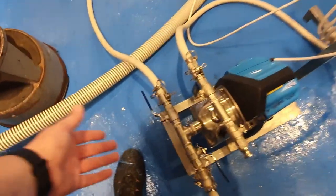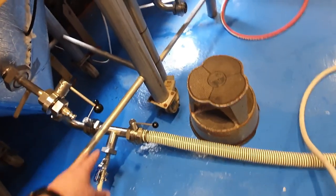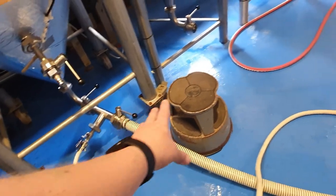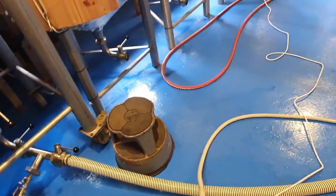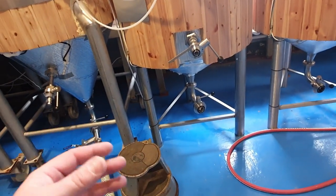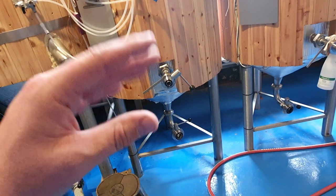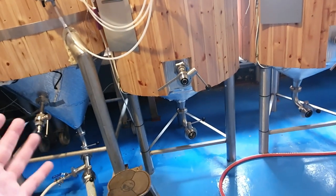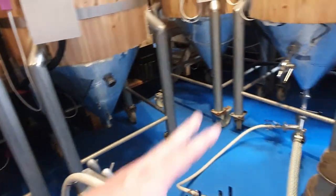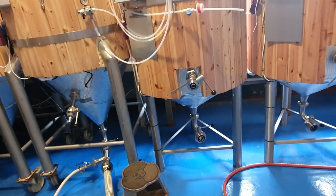All this can be closed off, disconnected, and taken away — I'm just going to leave it there for now because it's sealed and isolated. Then what we usually do is take the whole assembly off there and put it onto our next tank. Sometimes if you're saving caustic — if you've got clean tanks and you're just using the caustic to get rid of any baked-on dirt — you can go through two or three tanks, providing that there's no residual CO2 in the tanks, because the CO2 completely destroys the cleaning effect of the caustic.